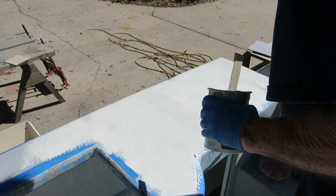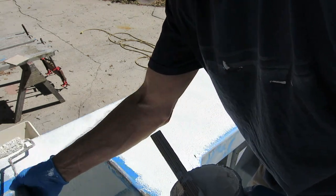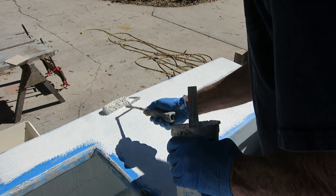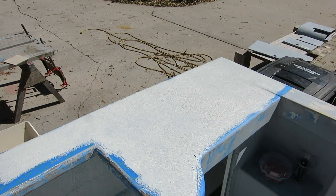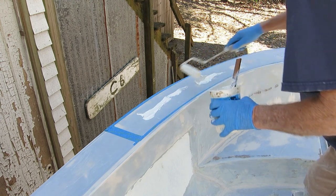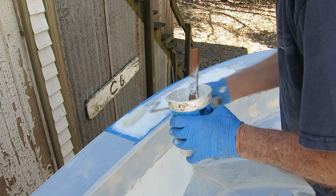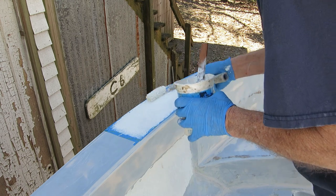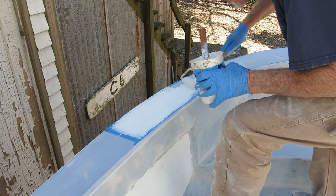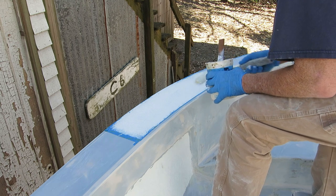What I'm after here: I'm using the epoxy because it's stronger than paint — you could probably do the same thing with regular paint — and I put the thickener in there so it would be sticky and stick to the roller. The thickener keeps it from self-leveling, so once it stands up on these little points — pretty happy with that. I'll let it dry and then hit it with the sander to knock the points off, and then we'll see what it does with some paint on it. Up front, I'm putting material down with the mixing stick first, then with the roller I'm putting a lot of force, trying to squish it out and spread it as evenly as possible. Once it's even, you go over it with the roller barely touching the surface, the coating sticks to the roughness of the roller and puts all these little peaks in it, and you just get off it and let it dry.